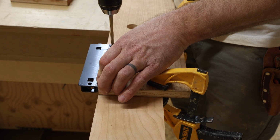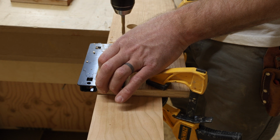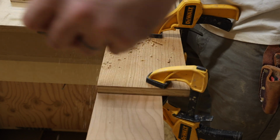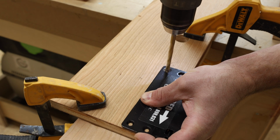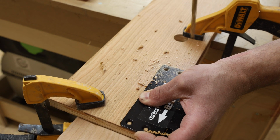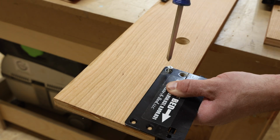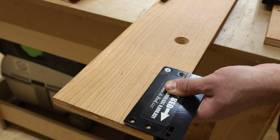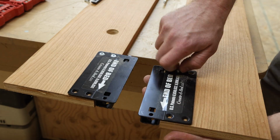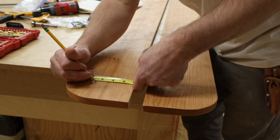And then this is the lower ball stud plate that is on the back side of our side rails, and this is where our actual pistons, they are gas pistons that open and close the bed, mount to, or it gets connected to. And this is adjustable, so you can adjust for different weight mattresses and all that. And so this gets some through bolts, and then we got some T-nuts that go through the outside, and then those screws go into those. And then the 2 screw holes in the back, we're not doing anything with right now, and in a little bit you'll see what those are for. So we repeat the same steps for the right side, and then we can move to the front.